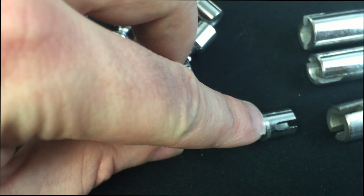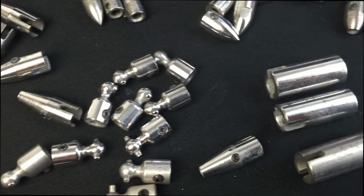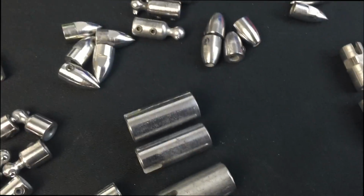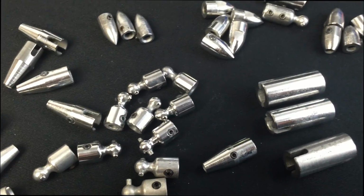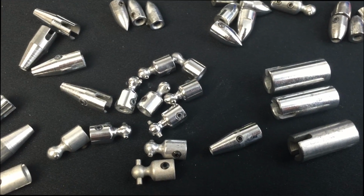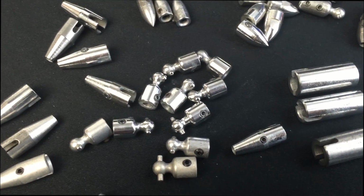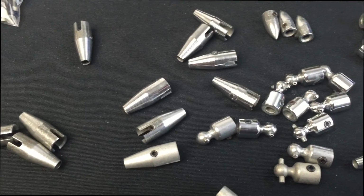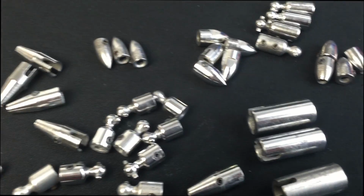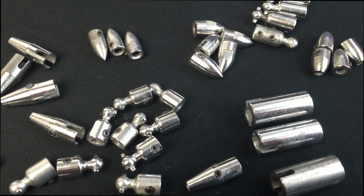But you can see right there that line. That's from tooling hitting the piece, or bad piece, very dull tooling, whatever. Some of that stuff doesn't come out as clean when you have a mark like that, because the media doesn't polish down in the grooves. But there you go. Just throw them in, let them go for hours, maybe more. It also depends on how old your media is and how dirty it is. The older it is, the longer it takes. My media is starting to get pretty old, so consequently it's not doing so good the first overnight. And I find when it starts to get older, it's 24 hours in the polisher to get it good. And I've used this media for a while now. I've used it for some lug nuts off the car, some chrome lug nuts, and then some pinball parts.